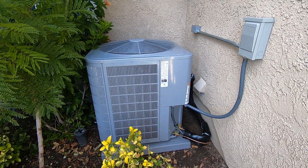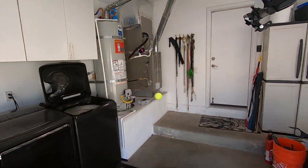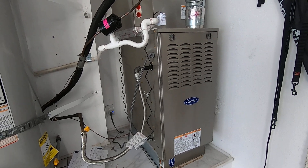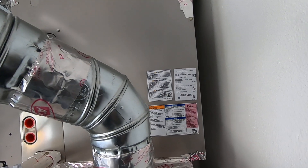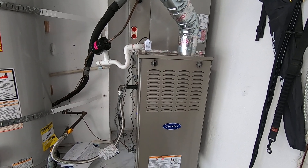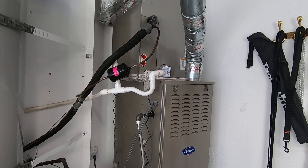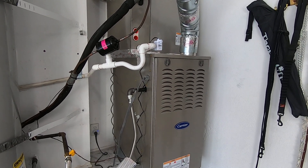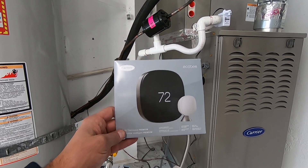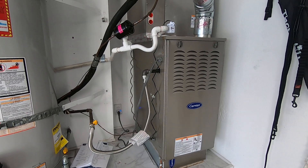I'm going to tell you about the dual fuel and how it works. In here we have the furnace, which is a Carrier furnace — model 58SU0B040M1712. Then we have a Carrier coil, the CAMPMP4821ALA. So in here we have a gas furnace, and outside we have a heat pump condenser — that is what makes it dual fuel. We have the evaporator coil on top that is rated for heat pumps. We matched it with an Ecobee thermostat powered by Carrier, and within this thermostat I am able to set thresholds for when it will run all electric heat or gas heating.